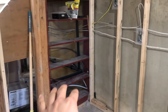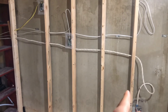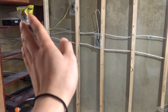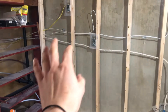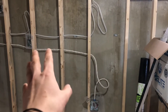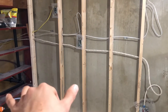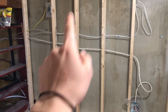The sinks go there, and the countertop space from the stove to the sink is definitely more than three feet. So from the sink — which is the beginning — within three feet I need a plug, and from the edge of the stove within three feet I need a plug. If one plug is within three feet of both, I'll be fine. I'll need to do some measurements, as I might need two plugs rather than one.